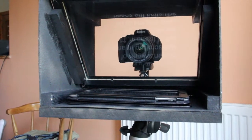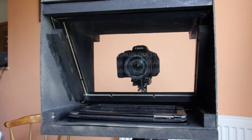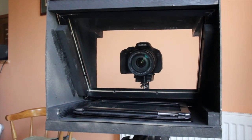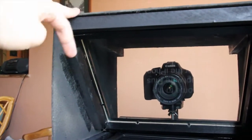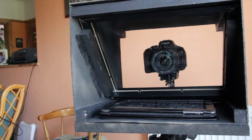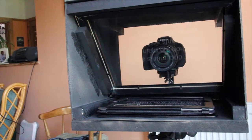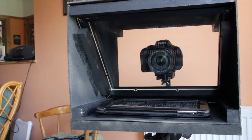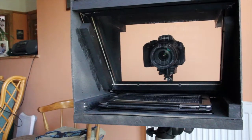And I would probably use a thicker bit of wood. The idea behind using hardboard and batten was to keep it light, but in retrospect that doesn't matter as much to me as some of the finishing here. If it was maybe a 9 or 12mm bit of wood, you'd get a nice stiffer finish to the whole thing, and take a bit more time and care over it if you want a neater job. But overall, like I said, this thing works.